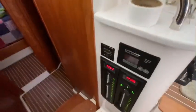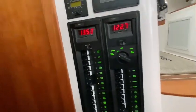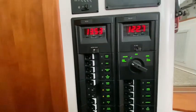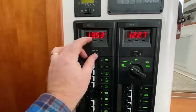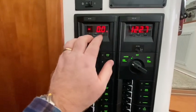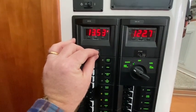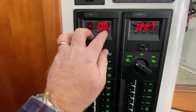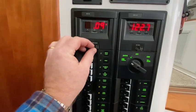Let's go back to the main panel now that the 12 volt DC is on. We can see how many amps are pulling through. We have two battery banks running on 4D sized AGM (absorbed glass mat) batteries. Battery bank one is currently at 13.53 volts — not really pulling any power. Battery bank two is running about the same, also pulling basically no amps. Battery bank three doesn't exist, so it shows nothing.